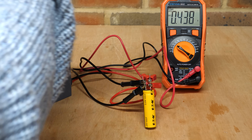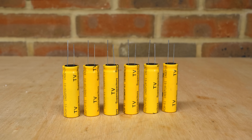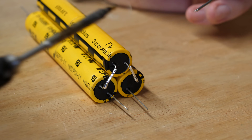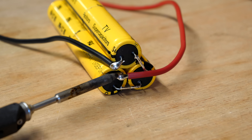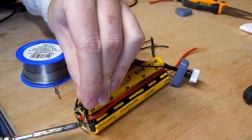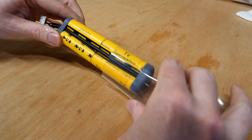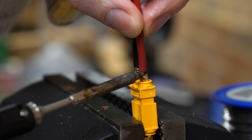The only problem is the supercapacitors have a low rated voltage of only 3 volts, so I'm going to use six of them. By gluing the capacitors together, I can solder them in series to increase the rated voltage to 18 volts. This does reduce the total capacitance of the pack, but the energy stored is now 0.75 watt hours. Having them soldered in series means it requires a balance lead to regulate the voltage of each individual capacitor to prevent any over-voltage failures. They can then be packaged with 3D printed end caps and heat shrink for protection, before soldering on a power connector for charging and discharging.